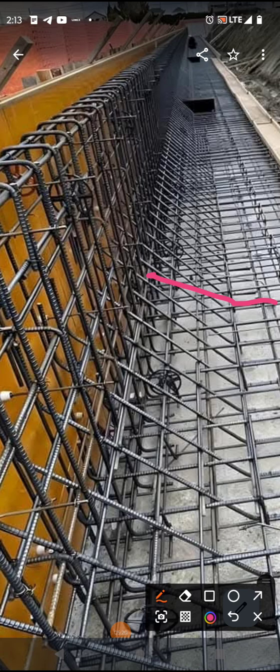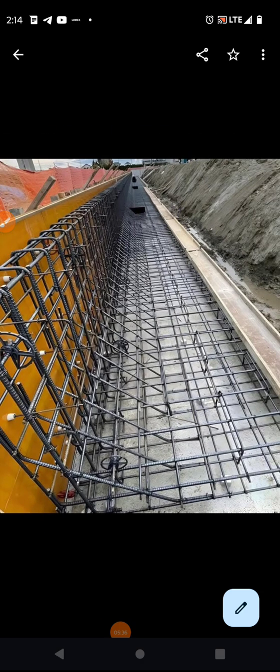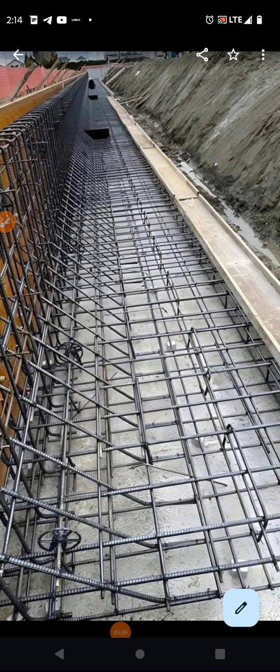That's weight. Why do I say weight? Because there's nothing locking this in. I want you to now see it. It appears to be concrete, that they've set this new rebar caging reinforcement up on top of concrete, just sitting on top. But what are they missing there? A keyway. There's nothing to stop this from sliding off. So the weight of the soil and water, etc., can have this slide.